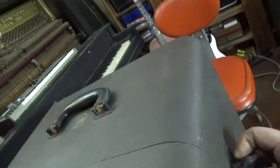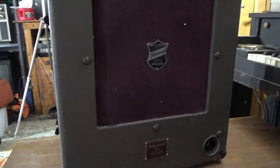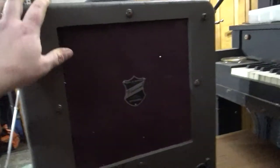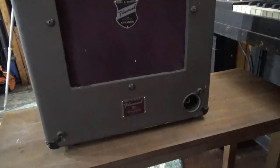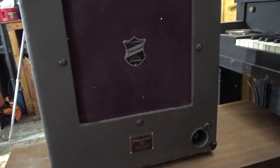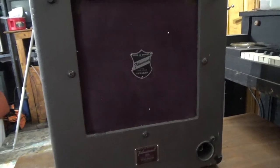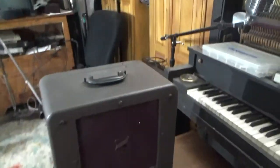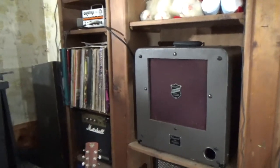So I'm going to have a look around the front. Now, I don't actually have a Filmosound 179 projector. Of course, I don't intend to use it that way. And in fact, the very next thing I'm going to do here momentarily is find my electrical testers and check the impedance and make sure that the speaker has proper values. I was so pleased when I bought the old one and it being 16 ohms on the nose.